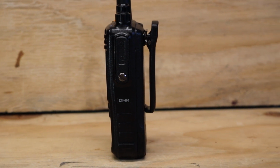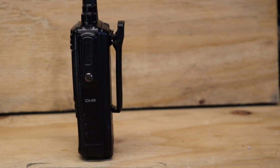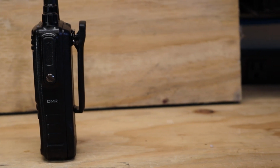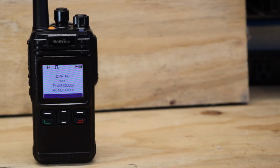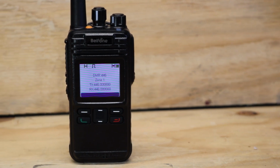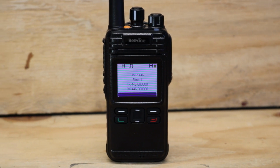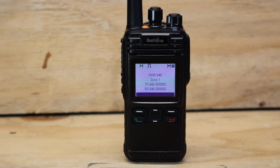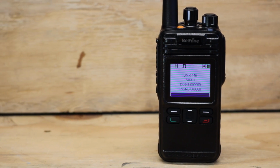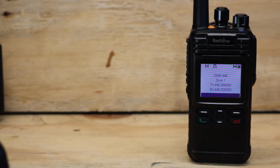It has a lone worker mode, which requires a response from the user at set intervals and triggers an alarm if the response is not received. It also has emergency alert functions and is capable of DMO pseudo-trunk, allowing the use of both time slots on a single DMR frequency. It has digital and analog dual modes to receive both analog and digital signals on the same channel, and can automatically switch into the needed mode for efficient communications.